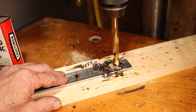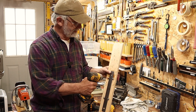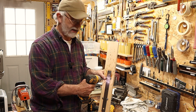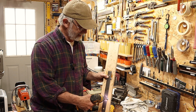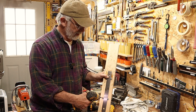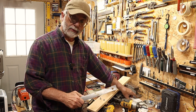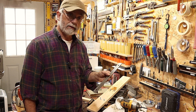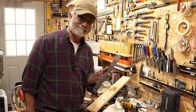There we go - beautiful. So now you know how to drill holes - large holes, half inch is a pretty good size - in bar stock, three sixteenths. You can do it by hand, but it is a whole lot easier with the drill press. Keep the speed low, keep it lubricated, clamp your work, make a good center punch for your bit to center into, and wear your safety glasses. You will have a good experience doing this. Thank you very much for watching. We'll see you in the next one.